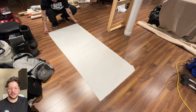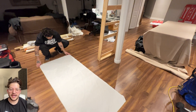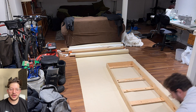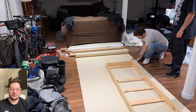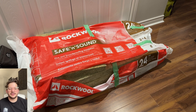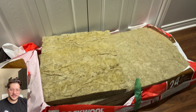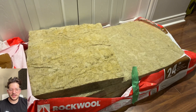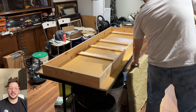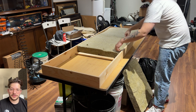Here is the rear upholstery — I'm using a standard muslin fabric for the rear side of the panel. Now we're rolling out the front face fabric, an off-white cotton canvas for the front face of the panel. Here's the insulation we're using: it is Rockwool Safe and Sound, two feet by four feet and three inches thick. Depending on where you are in the world your acoustic insulation choices may vary — here in the Toronto, Canada area this is the most available for this use.